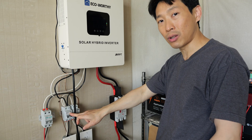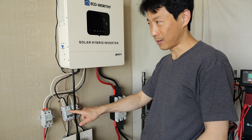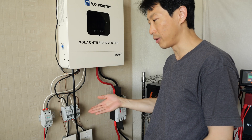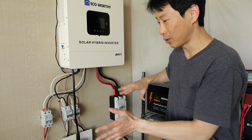I initially installed a 25 amp breaker, meaning each of these circuits maxes out at 3 kilowatts. This is a 5 kilowatt inverter, so I need two of them. I initially planned to have two but got lazy and only installed one. I added the second one and I know this whole thing looks very crazy — it's unprotected, so this entire room is kind of like an electrical room.